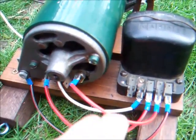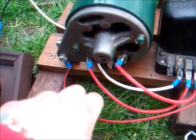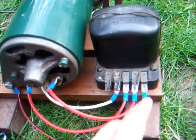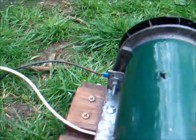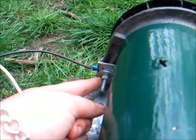So that's those two wires from the Dynamo — no more wires come from the Dynamo, that is it. We have our negative here, and that runs from E on the regulator box to the mounting bracket of the Dynamo. Then we run our negative from the opposite side of the Dynamo mounting bracket.